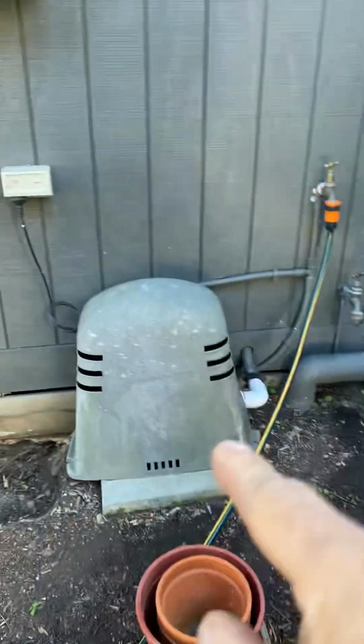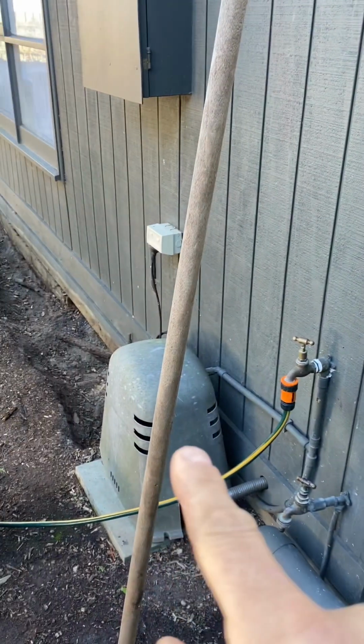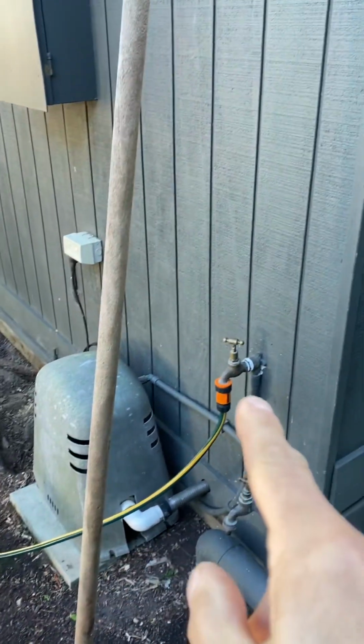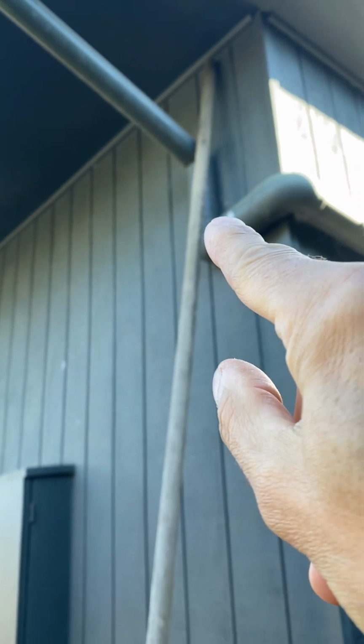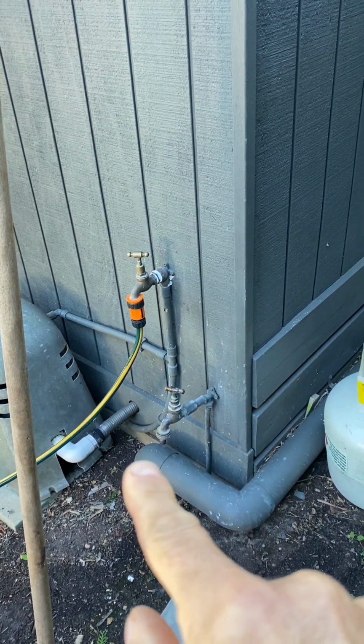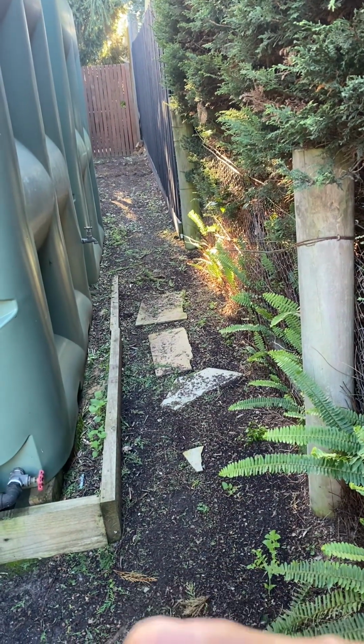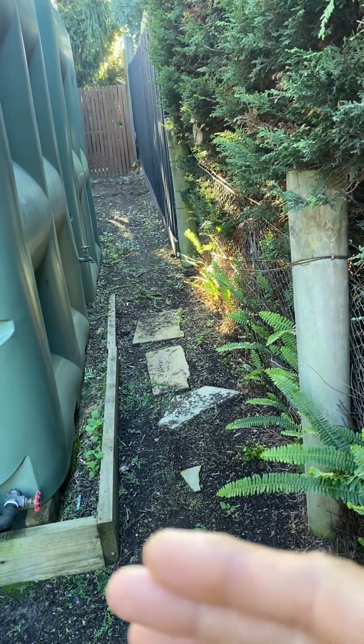Now this pump and the water tanks will be removed. So there's 2 tanks here. We're going to remove these. The plumbing will be removed and this pump will be removed. The tap associated we'll take off, and all we have to do is connect this down pipe here from this point straight down onto the overflow pipe here. We would like to then scrape a couple of 100 mil off all of this side across here, and we'll cover this with some stones just to allow air underneath the house.